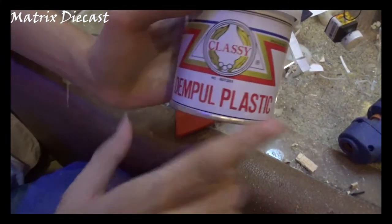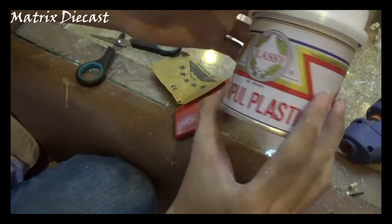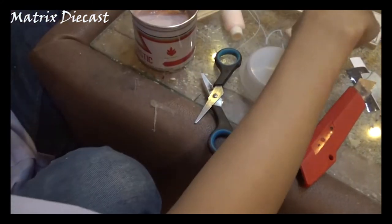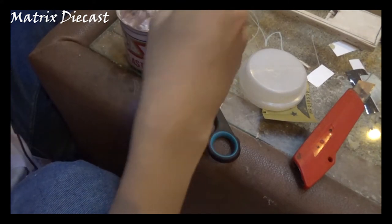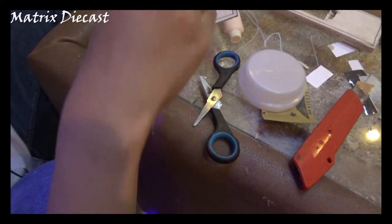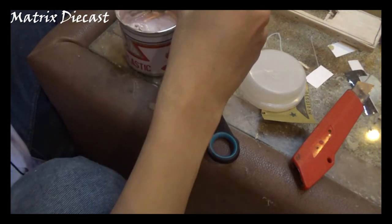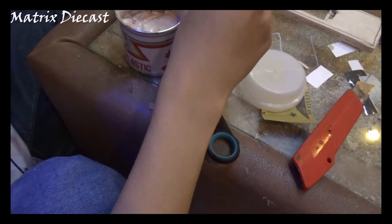Now, after we sand it with sandpaper, we close the pores of the side plywood with wood putty. I buy this item at a building shop. If you are Indonesian, you can call it dempul kayu, and you can buy it at your building shop too.